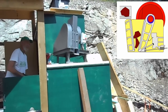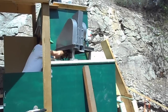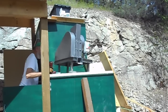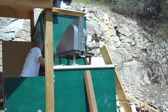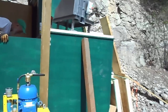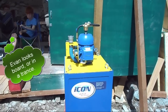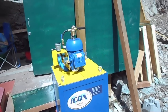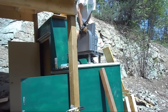We're mounting it right now up nice and high because we're going to — Jaws. That name's been taken, probably. I was trying to do the theme music of Jaws there. So we're mounting up nice and high so gravity can do our work here. As it comes out of the jaw crusher, the primary crusher, it's going to go into an impact mill that's mounted down in front of it. And then it is going to go into the Icon centrifugal concentrator, also known as a gravity concentrator. But today's job is mounting up the big jaw crusher and once it's mounted I'm going to show it to you in action.